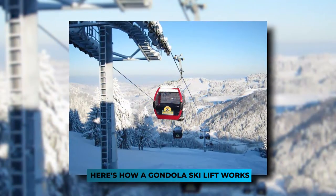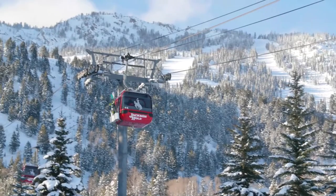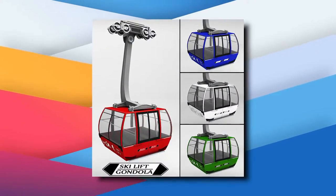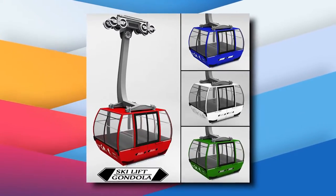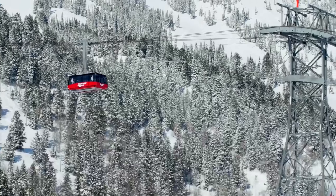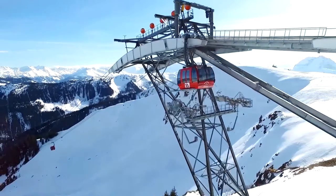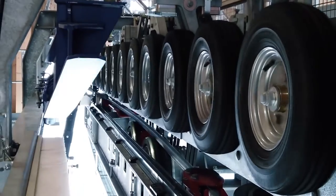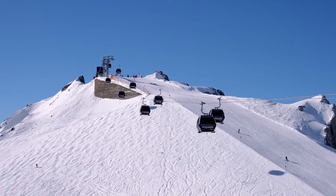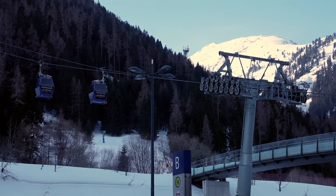Here's how a gondola ski lift works. The ski lift adopts its name from the Italian term gondola, a typical flat-bottomed rowing boat, and it's one of the most popular modes of cable transportation. It's got a complicated structure driven and supported from above by cable, made up of a loop of steel wires strung between two stations with transitional supporting towers. A clamp goes over a rail at end stations, pushing the clamp jaws open and allowing the lift to rise off the cable. The cable is then caught and gripped by a slow-moving chain, which propels the gondola around to the end of the primary pulley wheel. The gondola lift movement is slow, which makes it comfortable and safe for skiers to load and unload with zero injuries.